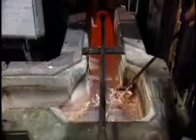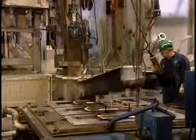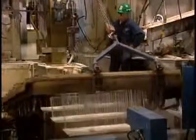This trough is used to transfer the aluminum from the remelting furnace to the tapping well. Molten aluminum runs in a movable trough located above the tapping well. At this stage, impurities are filtered out in special receptacles. The molds are cooled with water to accelerate the solidification of the molten aluminum.